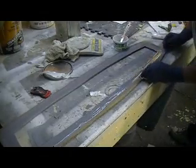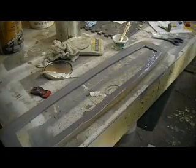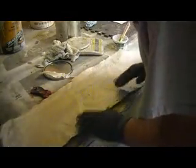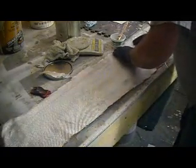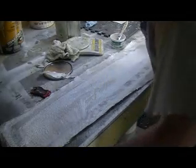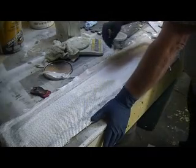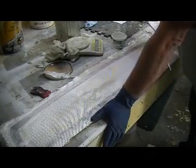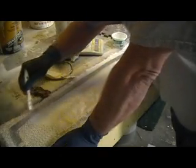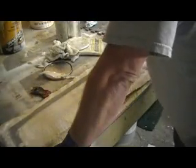Okay, now let's put some glass on here. There were a couple other questions about that peel ply stuff — no, it won't pull the part off the mold. You got to kind of be careful with it, but if you're careful you won't pull it off. I'm going to put two layers on this lip, go again, put it right on the part wet, and then it'll stick to the other part. That's the plan.